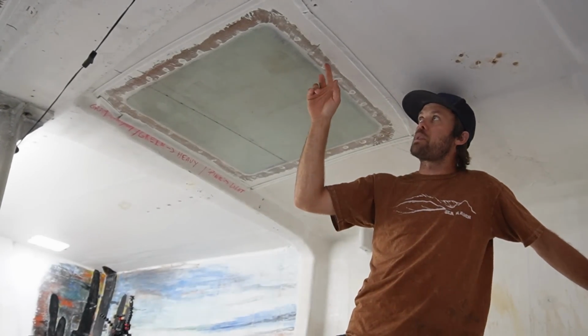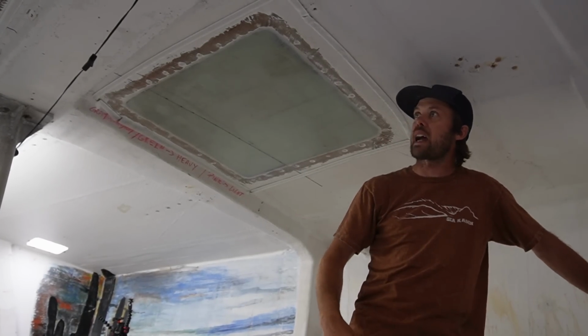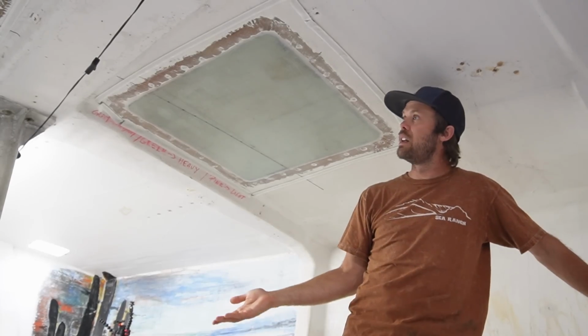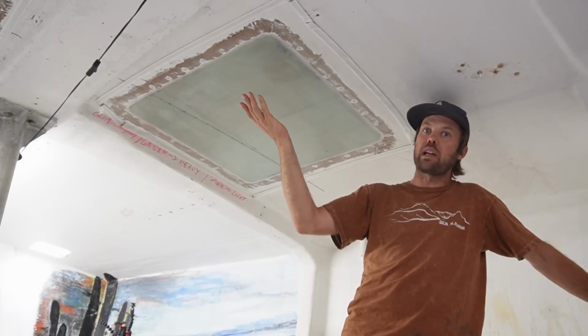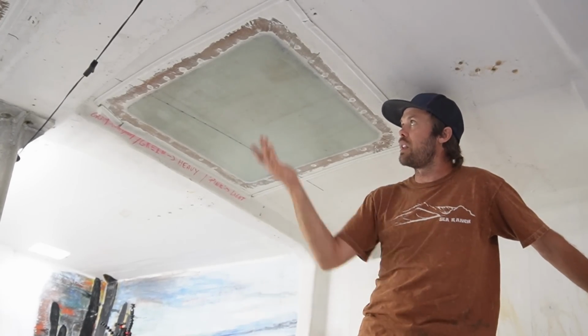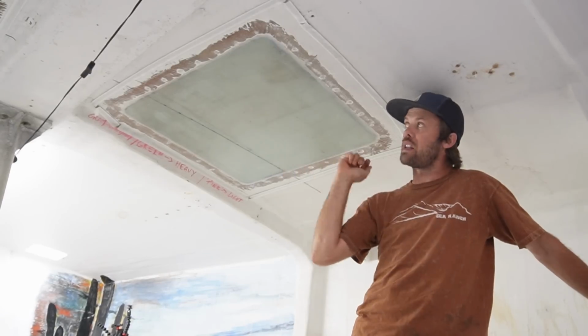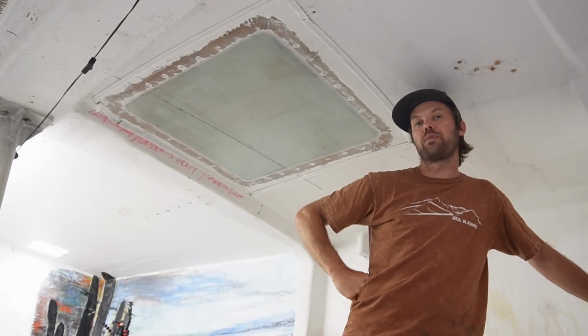I've actually already swept it with thickened epoxy and left it for an hour or more, and it's getting nice and tacky. The hard part about laminating on the underside of these is that it's hard to get glass to stick up there if it's heavy with resin. And so the surface being tacky, I can just stick it up dry and then wet it out in place. And then we'll vacuum bag them. So that's what we're doing this afternoon.